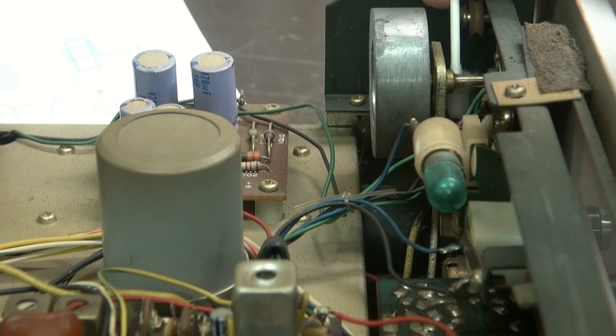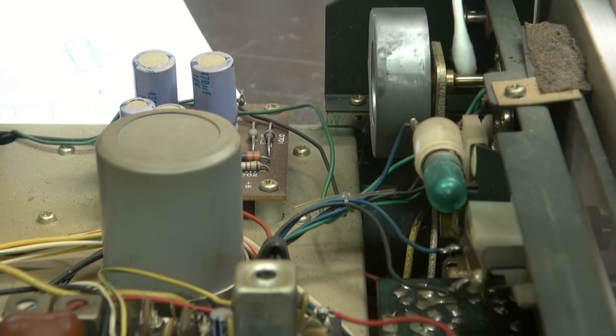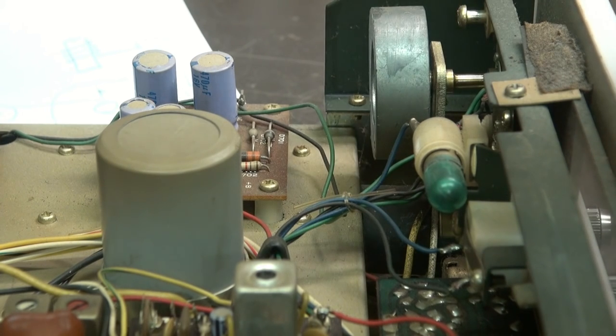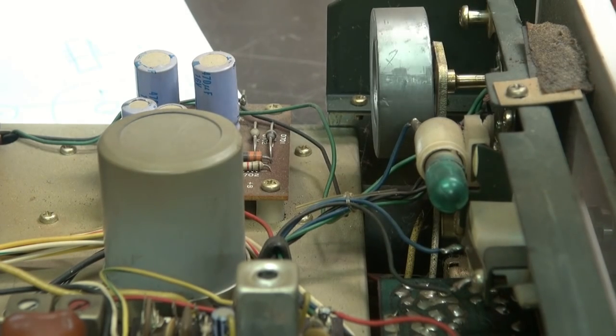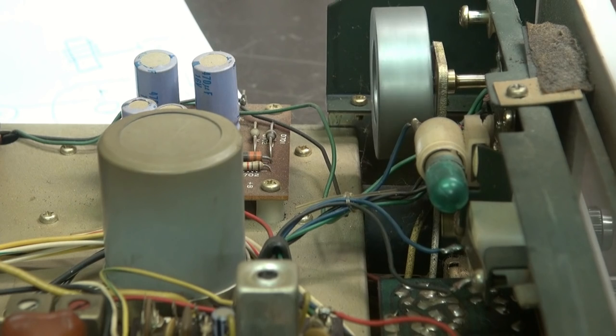Before you put the dial cord in, get in here and clean these surfaces — there's all kinds of crap in there from the old cord. Take a Q-tip with some alcohol and clean this. And then you hear this? She's rough, needs to be lubed. This is a great time to get in here and lube this back up so that she'll tune nice and easy when you're done. When you lube this, make sure that you don't get it on the surface where the dial cord string will be, or you'll contaminate the dial cord and it's going to fail prematurely. Get your lube in there and it's right back to maybe close to new.